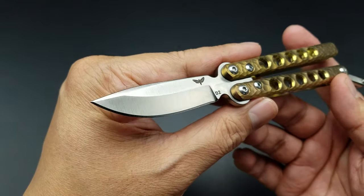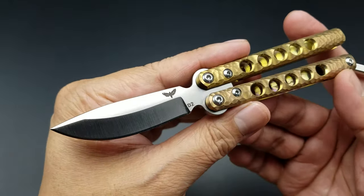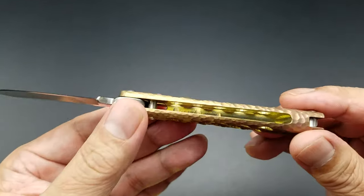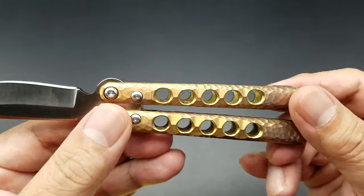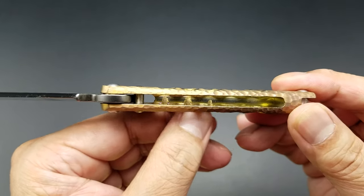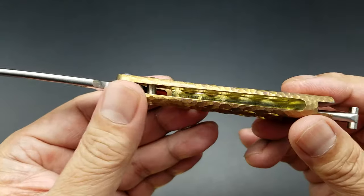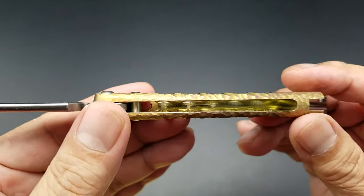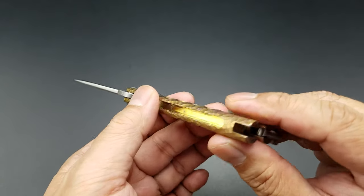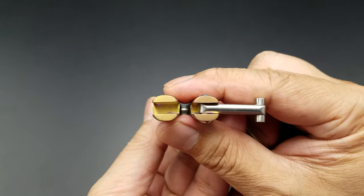The gentleman named it after a Himalayan mountain — he seems to name a lot of his knives with Himalayan-based names; Cali's Mercy is also Himalayan based. Again, it's channel construction — you might even see where he drilled the holes, there are some cutouts on the handle where the drill touched the sides. One-piece channel construction on the titanium, some beautiful anodization, and he contoured the blade nicely before doing the rock pattern. Fit and finish is pretty exquisite.